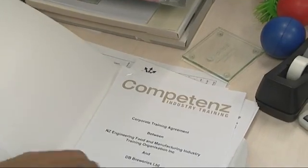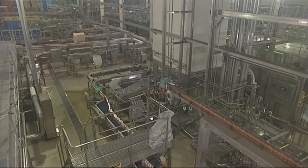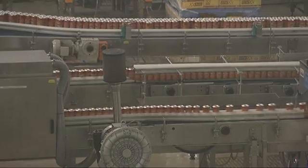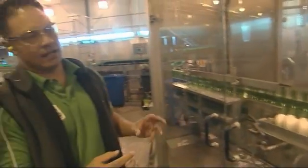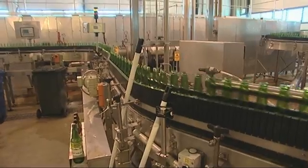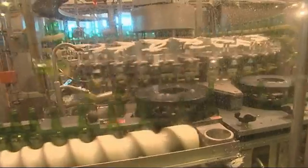Chris Hekatoa, DB Staff Development Coordinator, will be showing Harrison the packaging lines. Here at DB we have four lines: two glass lines, one keg line and one canning line. The empty bottles are uncrated and fed onto the conveyor. We're now at the machine called the Rinser. The purpose of this machine is to rinse every single bottle that comes through this carousel. So how many bottles come through here every hour? Approximately 23,000 bottles per hour, or roughly 380 bottles per minute — all of which are filled with beer and capped.